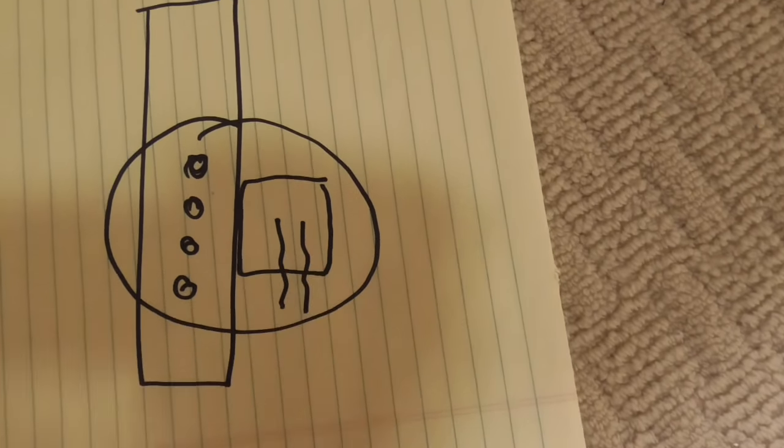Once we saw the stud, we just took the wire and shoved it down. Imagine we're coming from the switch, we shoved it down the hole, and then up the hole, and then down the hole, and then up the hole, and down the hole, and this sounds obscene, up the hole. So what ends up happening is you've got this nice big gap in the ceiling now. You route your wire through there.